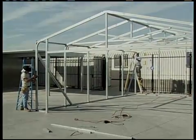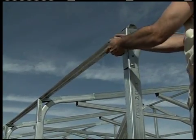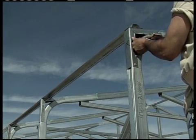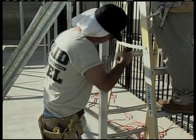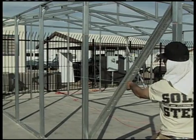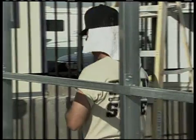Your girts on the top row should be three inches down from the edge of the eave. Whenever installing girts, a much cleaner job is achieved by measuring and marking the first and last vertical upright and then snapping a chalk line. Later, when applying the exterior panels to the outside, this will enable you to have a nice straight line of panel screws. Using clamps to hold parts in place is real handy throughout the installation of girts and purlins. After installing the top row, use a measuring tape to measure down 49 and a half inches on each end and then use a chalk line to guide your placement on all the other uprights. Remember, you won't be happy if you don't get your girts lined up with a chalk line.